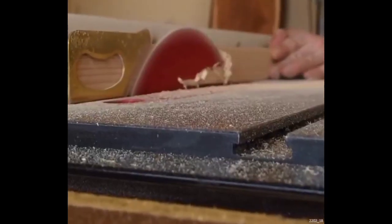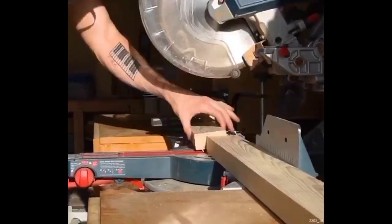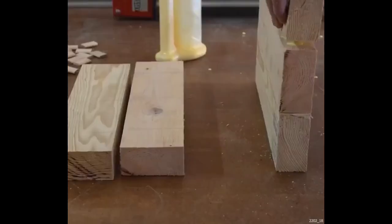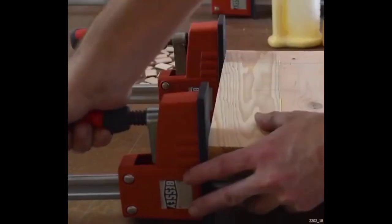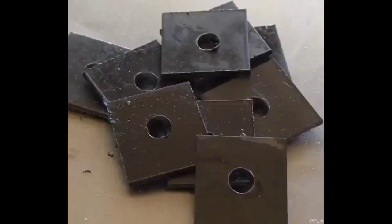With that done, onto the wood, the actual seat for this amazing stool. And each of them comprised of 5 sections of 2x4 connected with dominoes, plenty of wood glue, and then clamped together, allowed to set. In the meantime, some flat bar cut to be able to put together some adjustable feet.